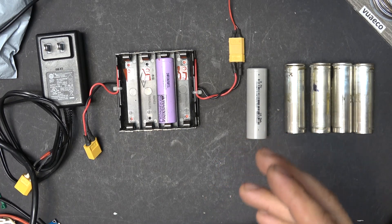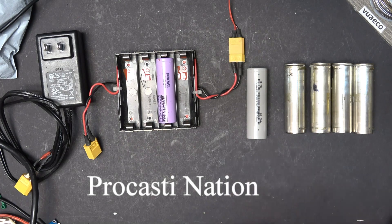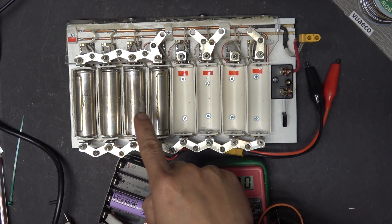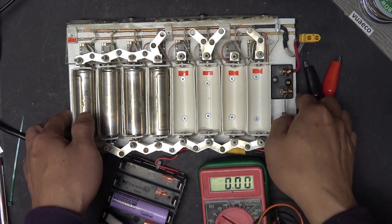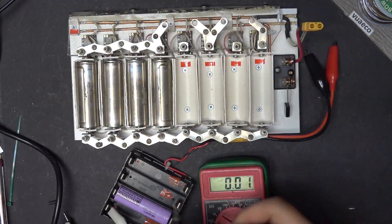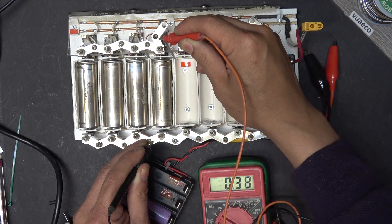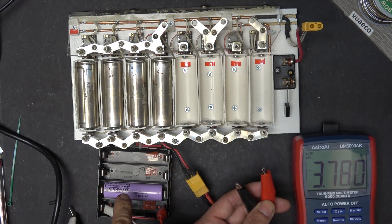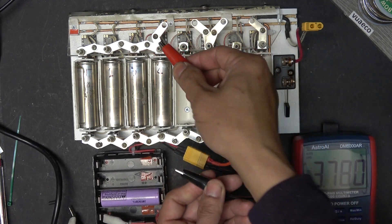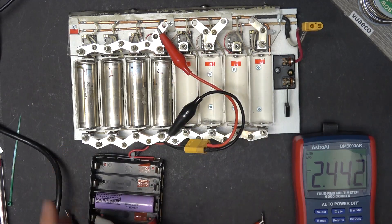I used to live in a country where there were a lot of lazy people — I got used to it. And that country is called procrastination. So here is the plan: I put 4 of these in parallel in my Frankenstein battery holder — I made this last week and I'll put a link in the description. Right now they are all at 0.38 volts. I've got a good 18650 cell ready at 3.78 volts, and I'm going to connect it in parallel to all of these dead 2170 cells.